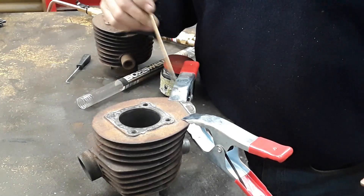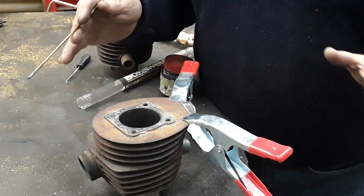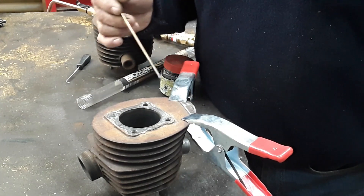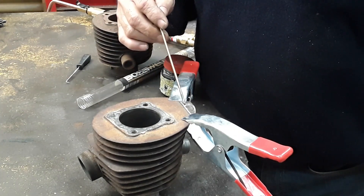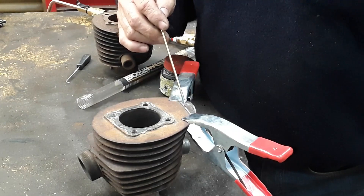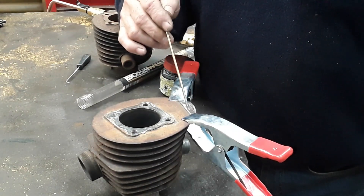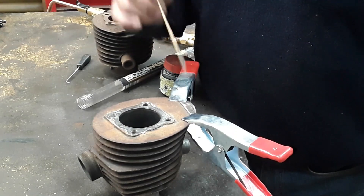Obviously cast iron — you've got to get a heat soak through it. If you localise the heat, it just cracks. So I'll be welding or bronzing along here. Let it cool a bit, take the clamps off and then finish my edges off.